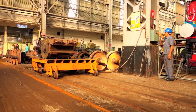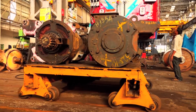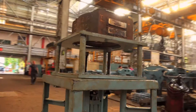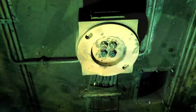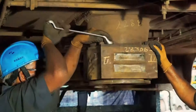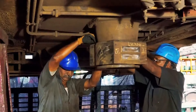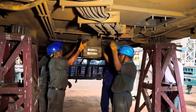In the series of various innovations done by this shed, the recent addition recognized at all India level is the mobile hydraulic jig for WAG-7 center pivot. The center pivot of the locomotive is a vital component which transfers traction and braking effort from the bogie to the body. Its various clearances and condition are so important that it is checked in every minor schedule, i.e., every two months, and also in the major schedule by dropping the total assembly from its position.